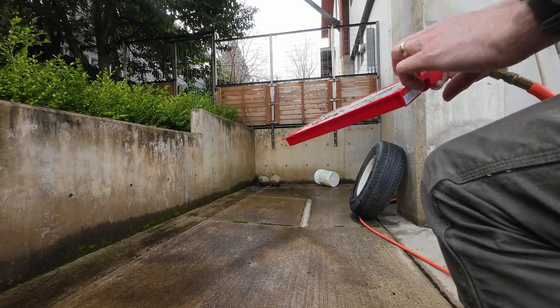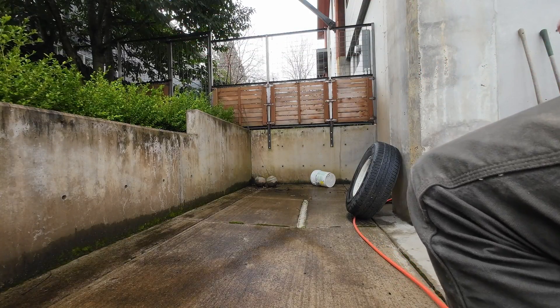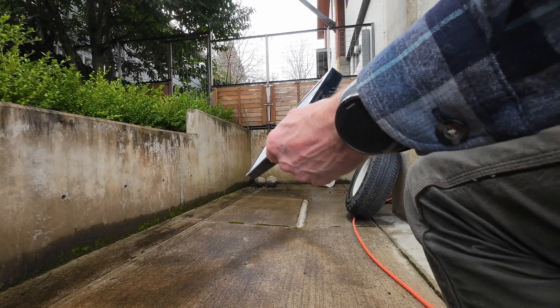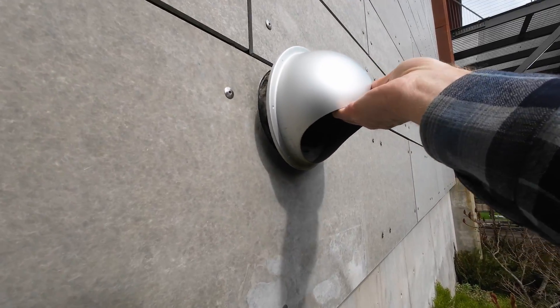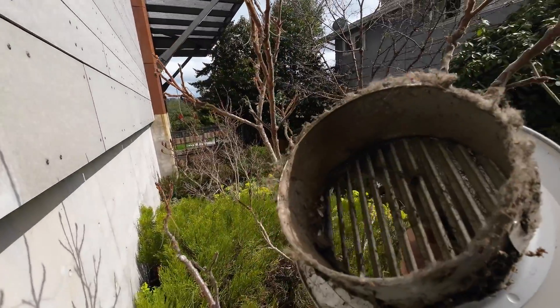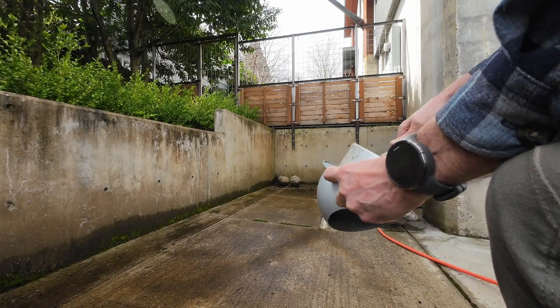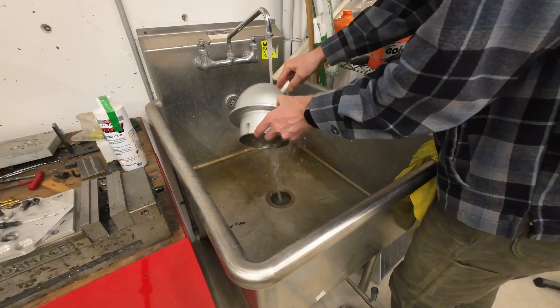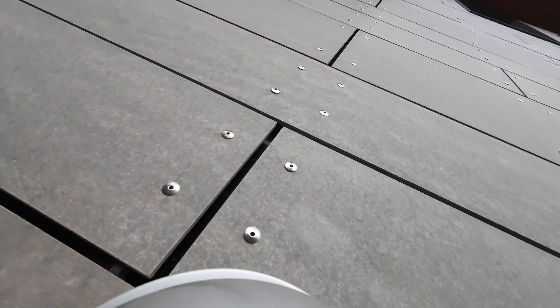Then you can close that back up. I'm just going to use compressed air to clear out these filters — I'll still want to replace that, but at least it'll extend the life a little bit while I've got it out. This next part is going to depend a whole lot on how your system is set up in your house. In my case I can pull out the intake — so you can see this is kind of messy. I can look down the pipe and inspect it to make sure it looks good, and it looks fine in there. But I'm going to take the air compressor and blow out this intake because that's where all the exterior mess comes in. Actually, it's dirty enough that I'm going to scrub it up inside in a sink. With that scrubbed up I can just put that back in — yours are all going to be different on different houses, but that's how ours works.